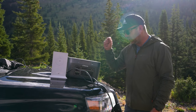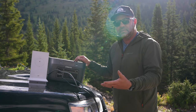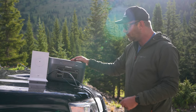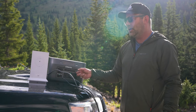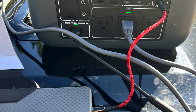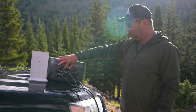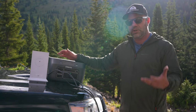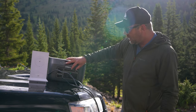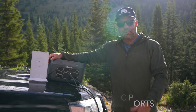A third way to charge is through USB-C power delivery at 100 watts. If you have another device that provides power, you can plug it in here, or you can power out. I often power out to my laptop, which needs around 60 watts — so this USB-C is my fastest way to charge the laptop. Then you get two USB-A at 5V/3A for lower power consumption things like headlamps and flashlights, plus two USB-C ports, great for charging action cameras, 360 cameras, and so forth.